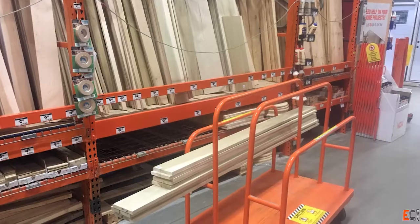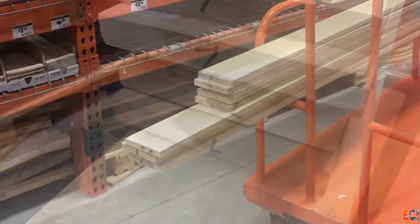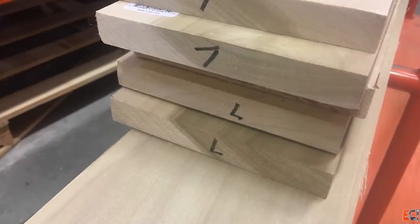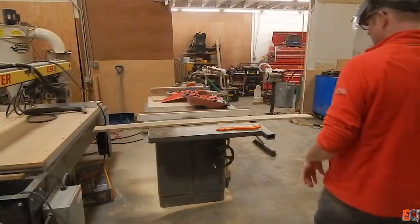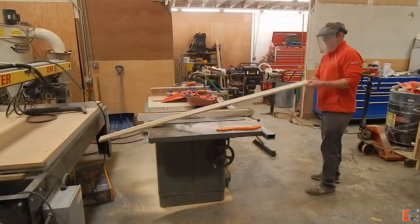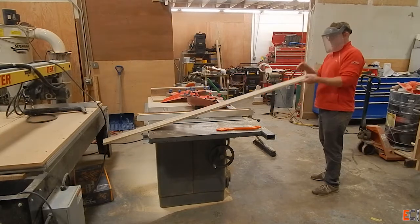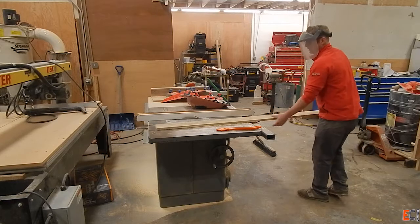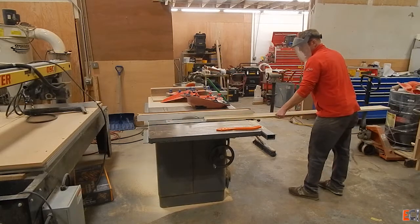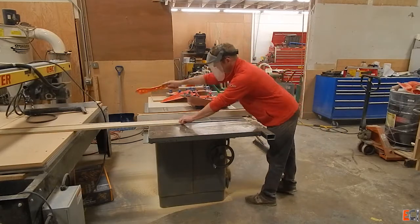Now we need some planking. I went to Home Depot and bought some poplar. I selected pieces that didn't have too many defects and were seven feet long, then ripped them up on the table saw to 12 millimeters, or roughly half an inch. It was a little scary — I missed my old SawStop table saw — but I had plenty of power. The only thing I worried about was my fingers.